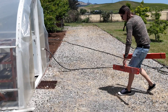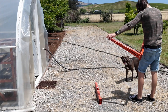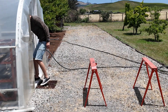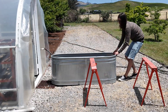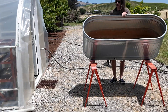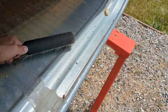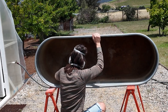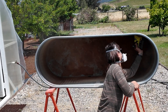While the printer handles business, I can get started cleaning up the trough. I previously used this as a chicken brooder, which led to the corrosion we're seeing inside. First, I get rid of the debris, and then follow up with the orbital sander. I'm just trying to remove some of the oxidation on the surface. If I leave it, the rust will continue and eventually make holes.